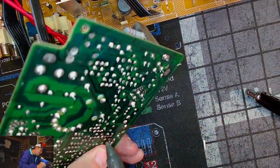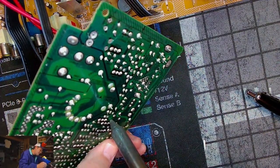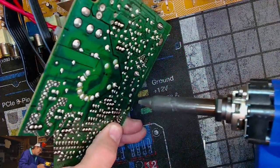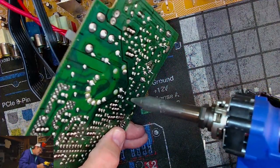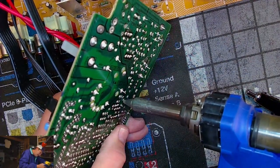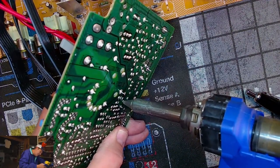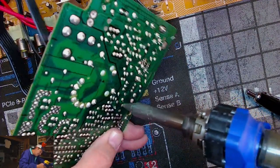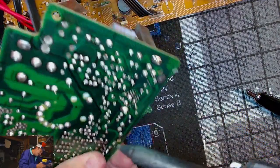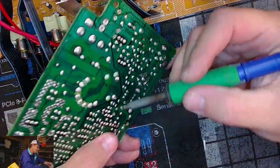Now if you do BVM cards where you're concerned with cap spacing, cap size, that's when you can get into that kind of stuff. Also, when we're having part problems like supply chain issues, that's more of a luxury. Sometimes you just have to take whatever you can get for a replacement cap.